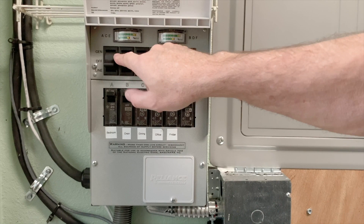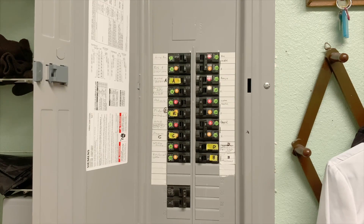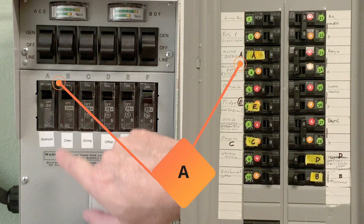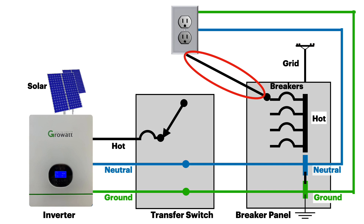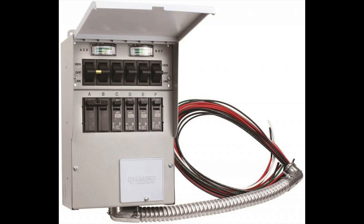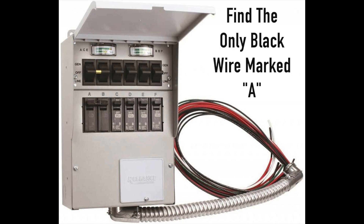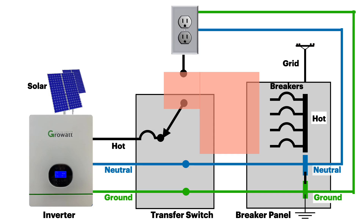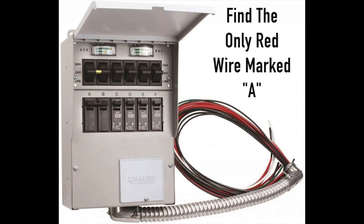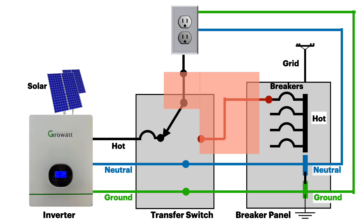Now let's wire up switch A — in my case I'm wiring it to the bedroom. Go into your breaker panel, identify the circuit you want to wire, and mark it with an A. That corresponds to circuit A on the transfer switch. In your main panel, find breaker A that you just marked. The wire already connecting to it is feeding that circuit — in my case the bedroom. Disconnect this existing wire from the breaker, then find the black wire marked A coming from the new wiring harness from the transfer switch. Connect the black wire A to the old circuit wire with a wire nut. Then find the red wire marked A from the harness and connect that to breaker A in your main panel.